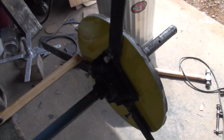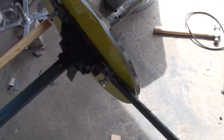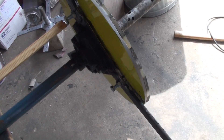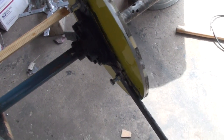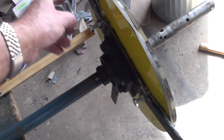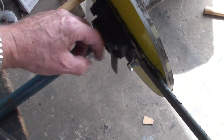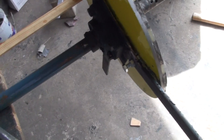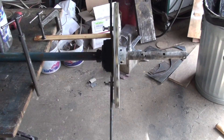My paint was a little wet here. This is what I came up with because the bearing does have some self-aligning, so that if the wings aren't perfect this can be offset. With the counter-rotating, you need to adjust that. So what I did is I tapped holes in the quarter-inch disc here, and I can move these nuts up or down and lock them to shift that disc if I need to.